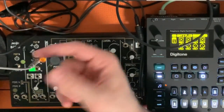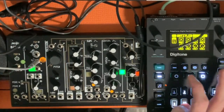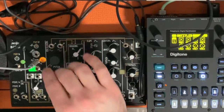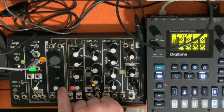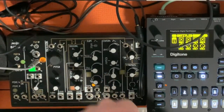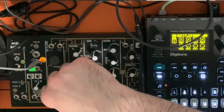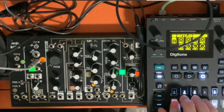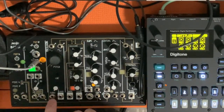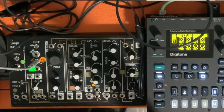Then there's two pitch knobs. There's the coarse setting, and there's a fine, which allows you to adjust within some amount of range around that coarse setting. Then we've got an attenuator for a linear FM input. So you can send input into this. It will FM the oscillator and cause modulations on top of that. And then you can set how much that applies. So zero counterclockwise is off and clockwise is full signal. There's no inversion with an attenuator on this. And then there's a voltage per octave input that you can use for sending things like pitch CV, a random source, something like that.